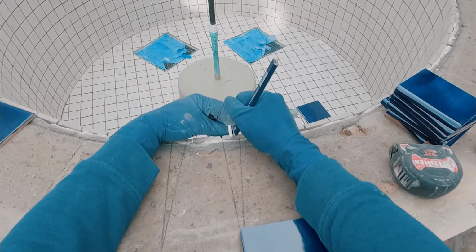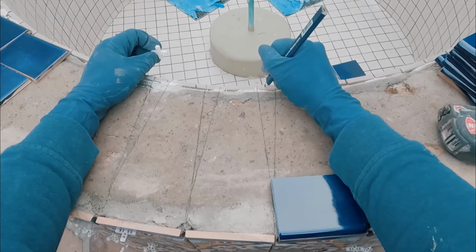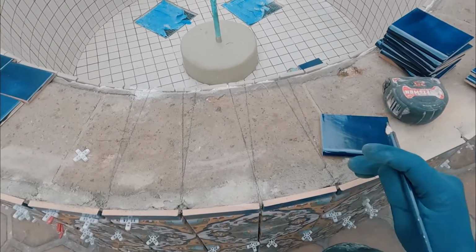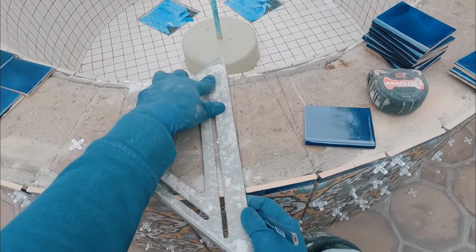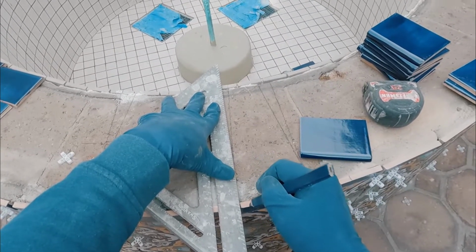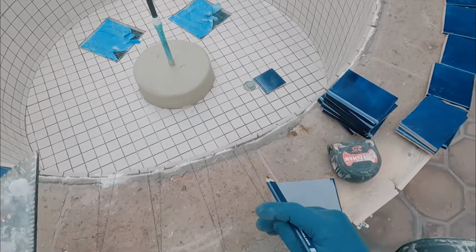So I'm going to go ahead and put like an 1/8 on each side of this, okay? That's going to be my cuts right there. So what I can technically do is go from this one here, and this is actually my cut line, okay? From there to there is where I'm gonna cut the tile. Obviously, if you draw these lines on here, it's gonna get crazy.